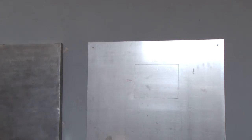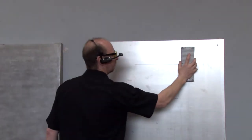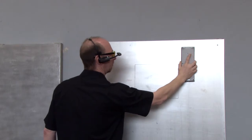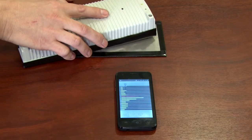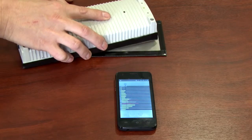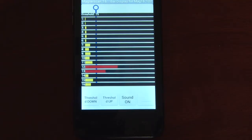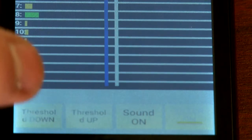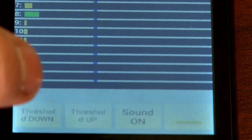To calibrate for the material being tested, hold the sensor transmitter on the surface, press the on-off button for one second and hold the unit still for two seconds. As the sensor transmitter is swiped across a surface, the individual sensors react and can be seen on the app as green for accept and red as reject within the parameters set by the operator. Amber indicates that scratches are detected but these are small enough to pass the test. The app has a new system for sensitivity that can be increased or decreased so that insignificant surface marks are disregarded.